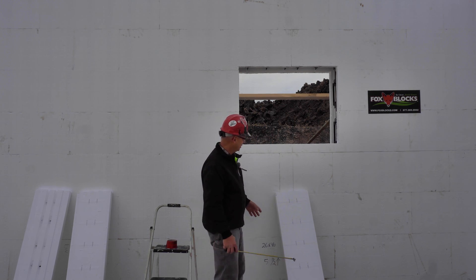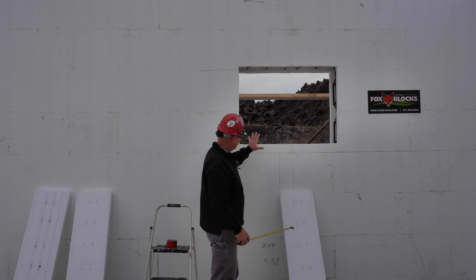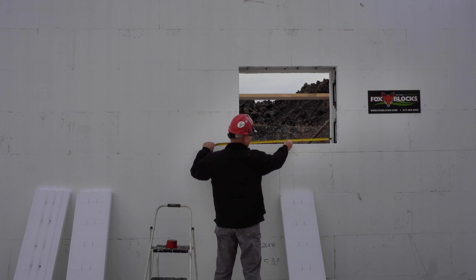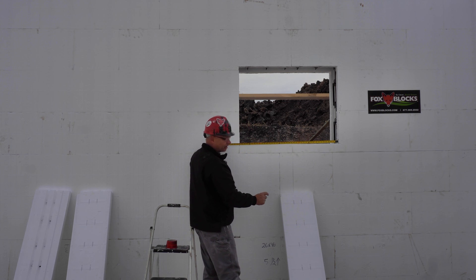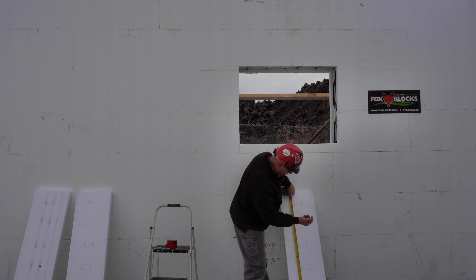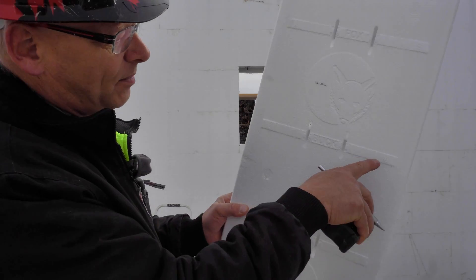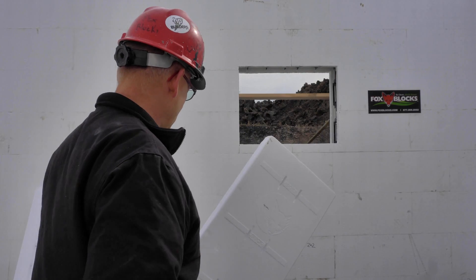The fox buck comes in one piece and they're four feet long. This rough opening happens to be 36 by 26. So 36 plus four — because we have to add two inches on either side for the thickness of the fox buck, since it's two inches thick — that makes 40 inches. If I mark at 40 inches, we'll see how that works. 40 inches works really well, and I want to make sure I'm not going to cut all the way through a cross tie — this is actually going to be dead center between the two.